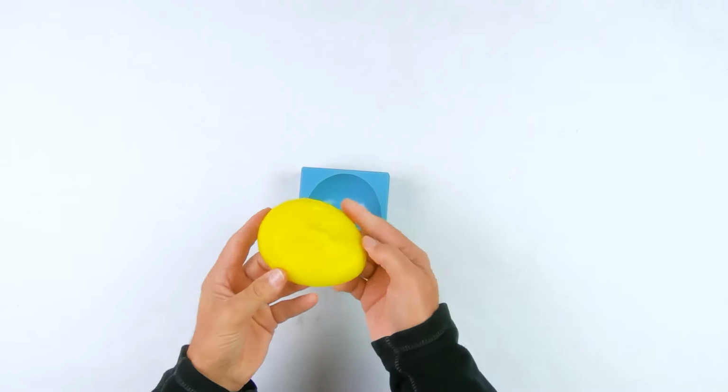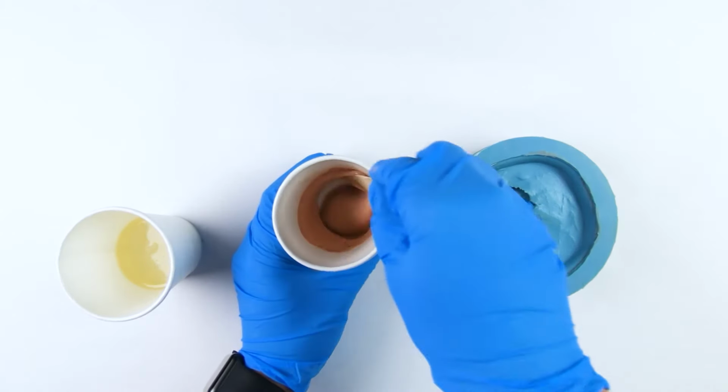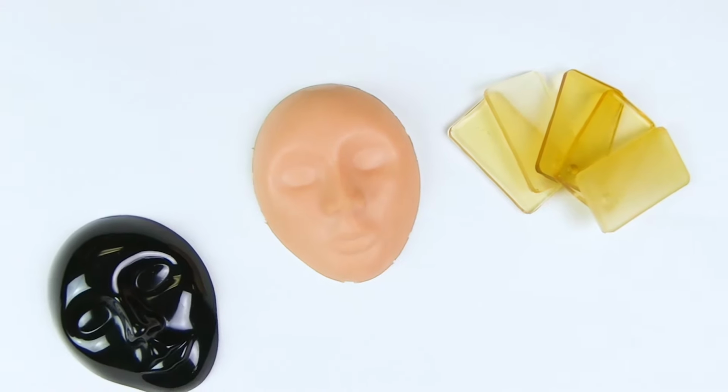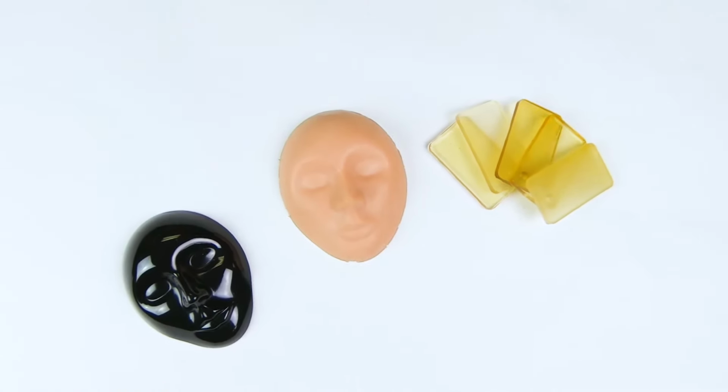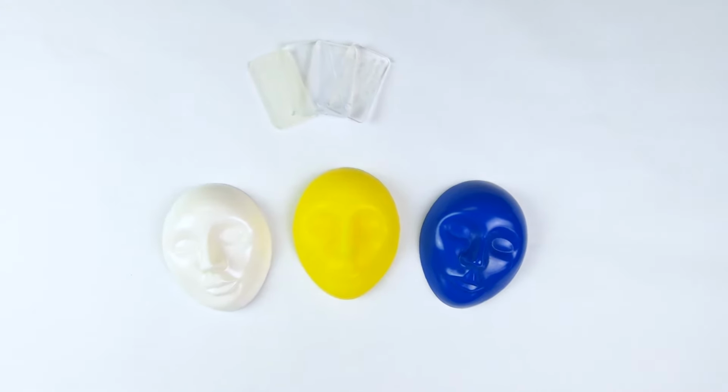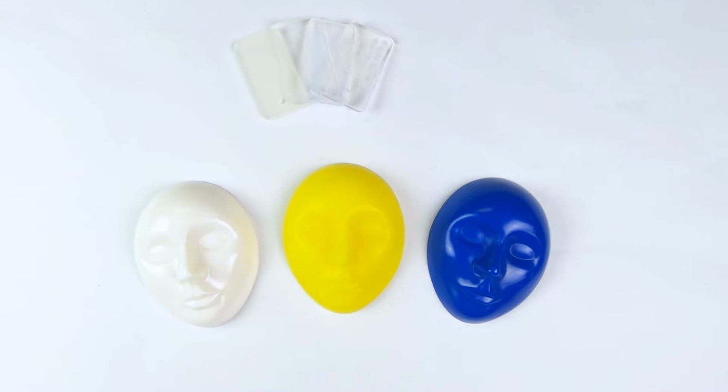When selecting a material for your project, make sure to keep in mind its natural color. Many of our Shore A products have a clear amber tint to them, so warm or darker colors usually work best. Our Shore A and D clear materials can be easily pigmented to any color you want, from light to dark.